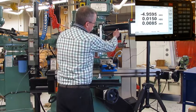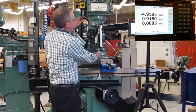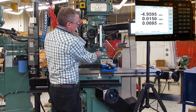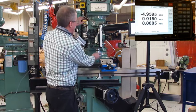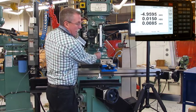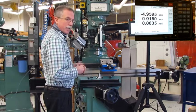I want to make sure that my handle is all the way up and my lock is on. I'm going to gently push my in button here, and that's going to activate my automatic draw bar. So I'm just going to give it a little bit of a push. You'll hear that motor run, and that pulls it in. Notice I can take it right back out by pushing the out button. When it goes in, draw it up so it's tight, and then give it one little quick burp — and that locks it in.